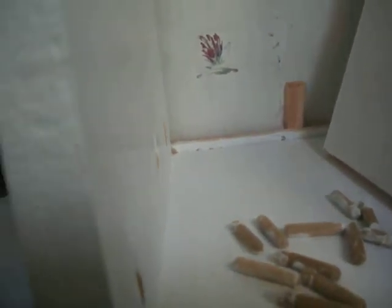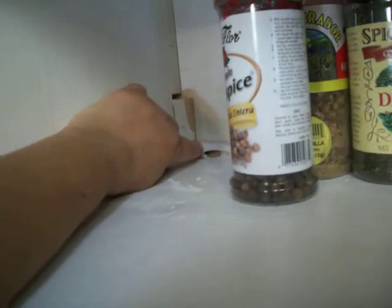I did put in, this is from the corner cabinet, and a couple of inches in is a stud that it's screwed into. So this end doesn't get any support till over here, because it's like 19 or 20 inches from there to there. Anyway, forget the math. There's not a stud over here on this side, so I use pocket holes to attach it there. So it's attached to this, and then the stud is about right there underneath.